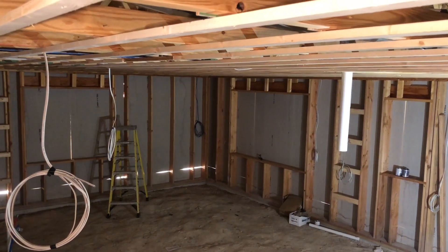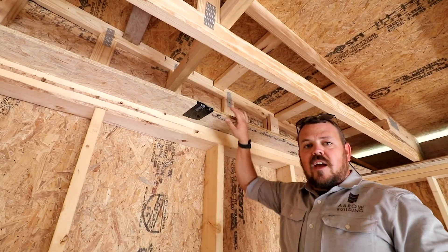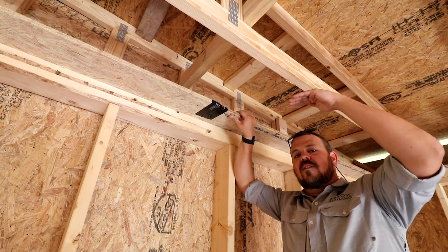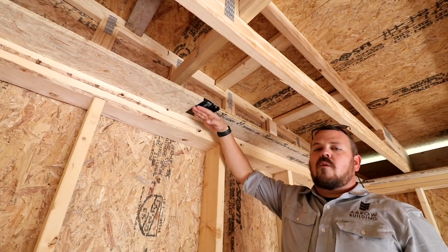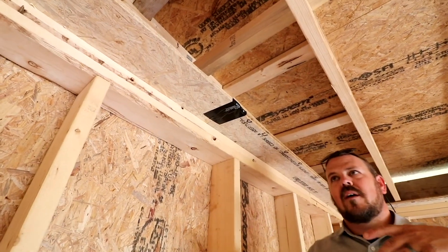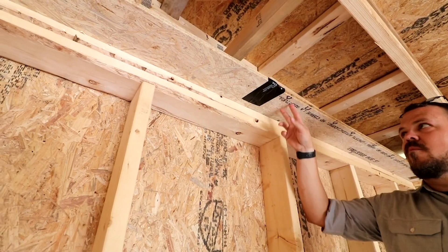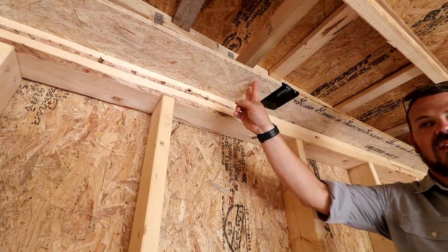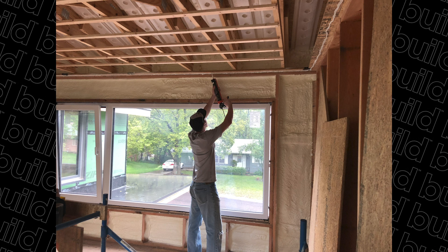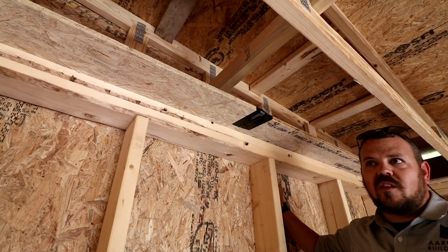This is our connection point to elevate to the same point that we have our strapping. Our air barrier is now from the foundation, two floors, to right here. At this point we're transitioning to drywall as our air barrier. The drywall will mount here. We also eliminate — or reduce — the amount of truss uplift that causes drywall cracking in this inside corner. We're going to run two beads of acoustical sealant along this length, and when the drywall gets screwed in place, that drywall is now sealed with those two beads of sealant to this Advantech, which is taped, rolled, and sealed to the zip sheathing on the outside.